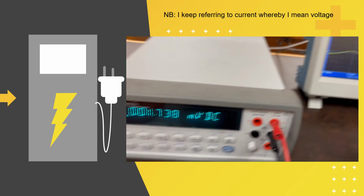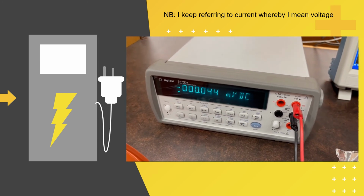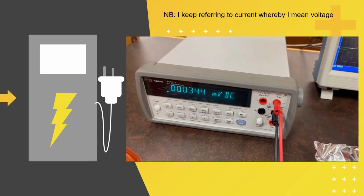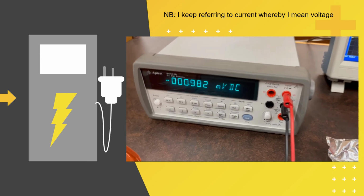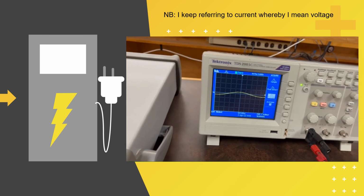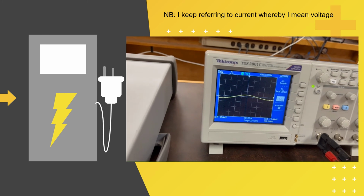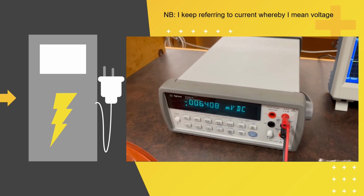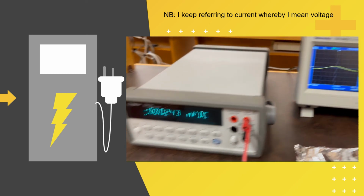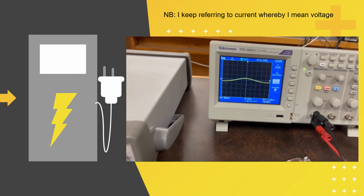Although, the one thing that is for sure is that I can't take for certain the noise coming out of this reading. It could be that when I apply pressure to the crystal, there's more noise being generated, and that's why I'm not going to be using the results from the multimeter for my experiment, but rather the oscilloscope measurements, because I think it's a better measurement of voltage over time. Essentially, the multimeter takes the voltage as an average, meanwhile the oscilloscope gives me the instantaneous voltage in the form of a sine curve.